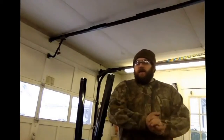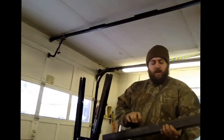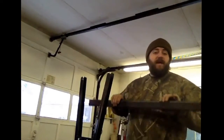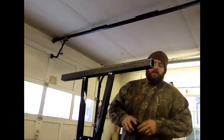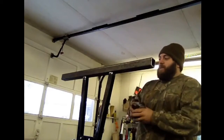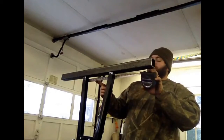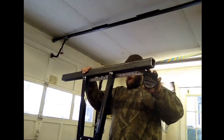Now that I'm done grinding, I have got my piece of 2-inch tubular and I've taken it and marked the halfway point on it — dead center. This was already the length I needed from the welding shop, so it worked out perfect. I've cleaned up the ends to get the burrs off. Now I'm going to take this and lay it up on top. I've got my tape measure here. I'm getting this centered and marked so when I go to weld it, if it moves, I'll know. I'm going to measure the outside of the frame from here to here — it is 13 inches. Thirteen inches divided by 2 is 6.5, so the halfway point on this plow frame is 6.5 inches. I've got to line up the line I made on the 2-inch tubular to 6.5, which is actually pretty close.